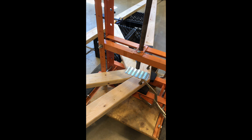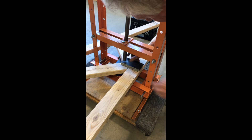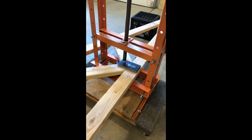I'm continuing on pressing the plates on my truss. I've done one side and flipped it over to the other side. Sometimes they don't press down flush all the way, so what you can do is position the plunger of the press in the particular area that you need to get snug down. If one side is a little bit high, just press a little bit in that one area to get the plate nice and flush.